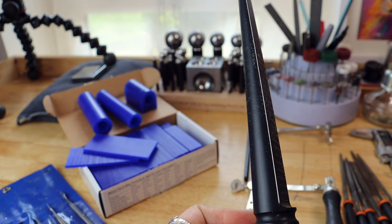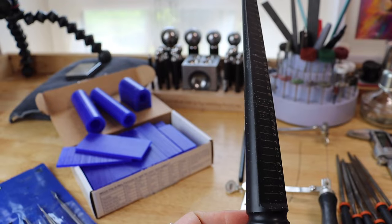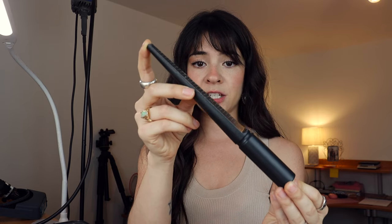The next thing that you're gonna want is a ring mandrel that has a blade on the side. They make them specifically for wax carving jewelry. You can see there's a shiny edge. This helps you blade out the ring size that you're looking for. So you just cut out the width that you need and then blade it out. And yeah, you're gonna definitely need one of these.